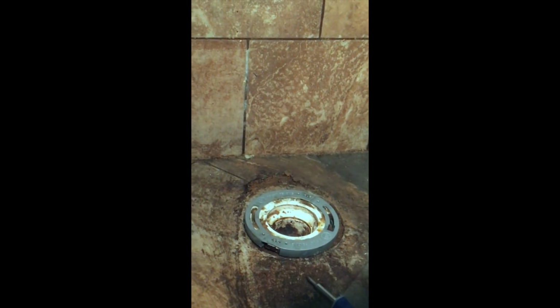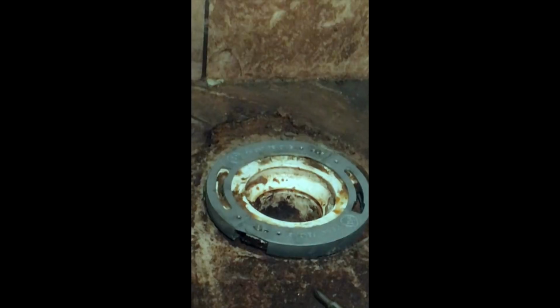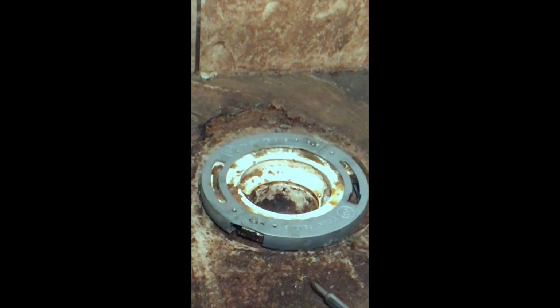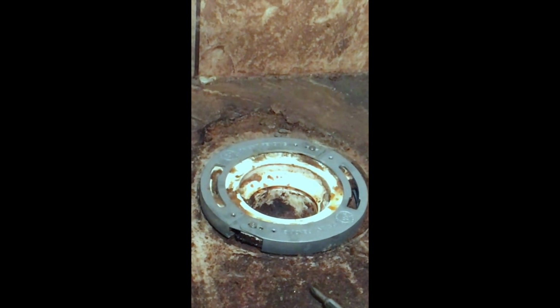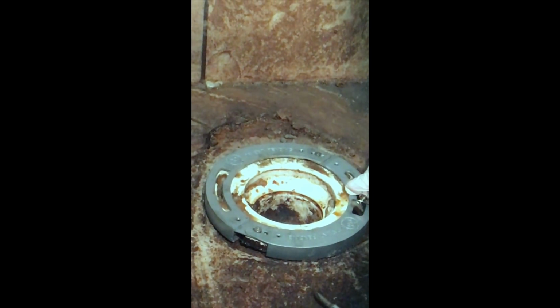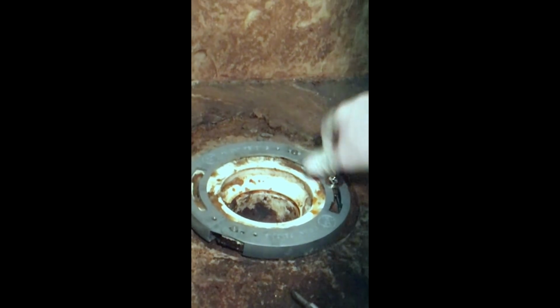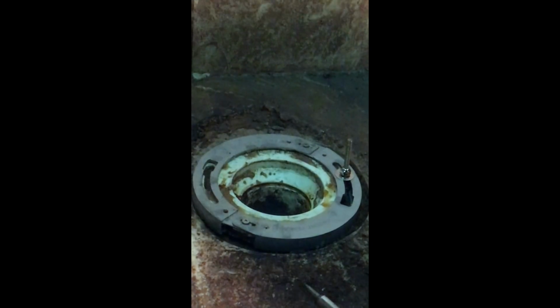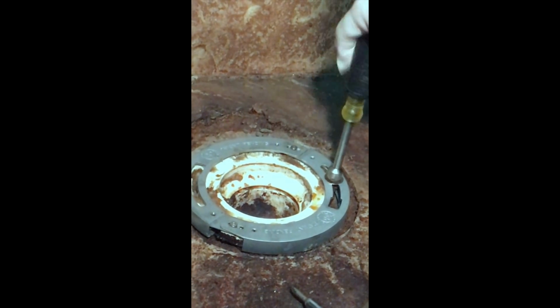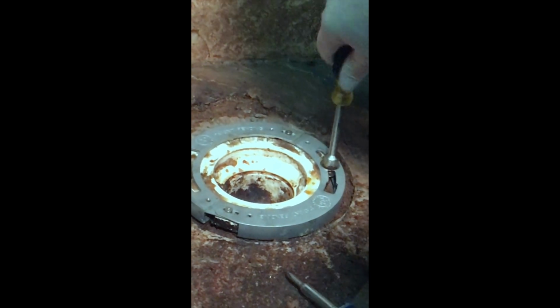At this point right now, we put our bolts in. We put our bolts in here. I always use 2 sets of steel bolts. I use one to secure the bolts to the flange, so they stand up straight when we go to set the toilet back. And here's the side that's broke, so she goes right in there where she needs to go. And we will tighten this guy up, make sure they're straight across here.